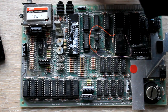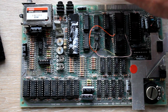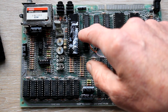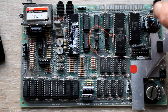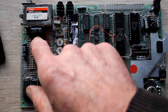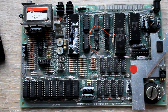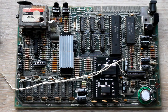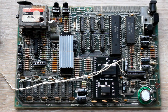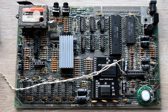Also, if you've got a rubber keyed ZX Spectrum, I don't know if there's enough room for this to fit actually. I'll have to read the instructions. This one's out of a rubber keyed ZX Spectrum and I don't think the ULA's broken in this one, so I'm going to take the ULA out of another one and put this one in. Also if that doesn't work, I'm going to try it because this had 22 volts on the 12 volt line and I think it blew something up. So this is the board I'll be swapping it with - this is my first original ZX Spectrum and it's been modified with a lot of things already, so this is my best one.